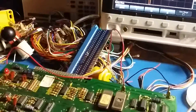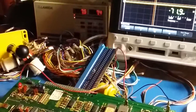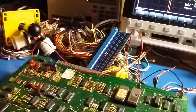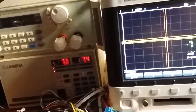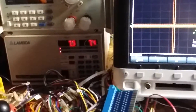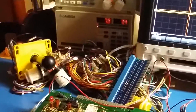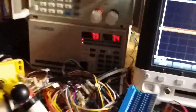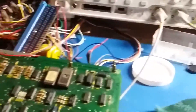This game is pretty picky. You need at least about 4.3 volts to get it started, and once it's started I think it can go down to about 4.1 before it dies, but you need almost 4.5 volts just to get it going. I have this beefy 20-amp power supply set for 8 amps and I'm drawing 7.4 amps — this thing takes a lot of power. Because of the tiny gauge wire, I need 7.5 volts just to get 5 volts at the board due to all the cable drop.